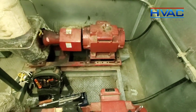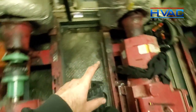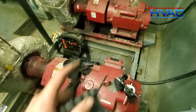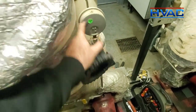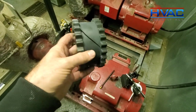So the other day I came in here and pumped two — this one here — so that's pump one, that's pump two, that's pump three. Pump two had a lot of vibration. The other pumps did as well, but pump two was so bad that these gauges right here were actually shaking. So this is what I found: a cracked coupling.